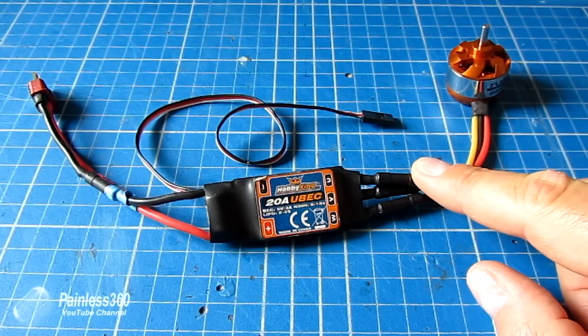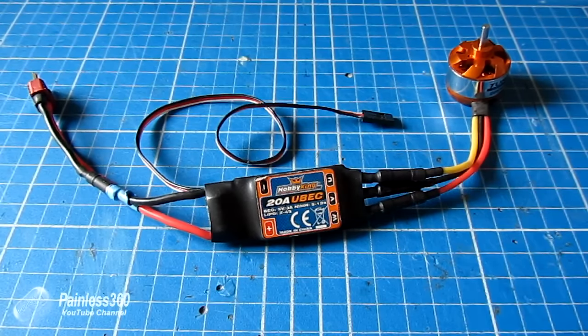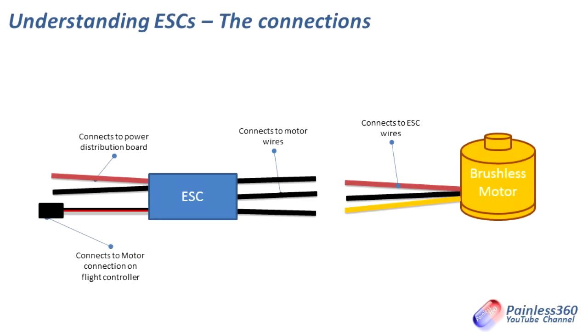So how do they actually work? A brushless motor is actually a three phase motor. Each of the wires connect to one of the three wires on the electronic speed controller. Here we have our three motor connections, and we can connect them to any one of the three wires coming out of the motor — all three must be connected. On the other side of the speed controller we have our classic black and red wires connecting to the flight battery. There's another cable supplying the plus five volts, and a signal wire telling the ESC how much power to allow through to the motor.